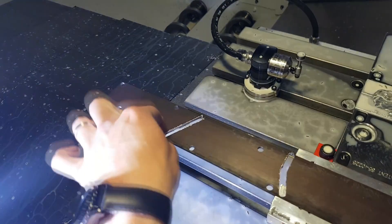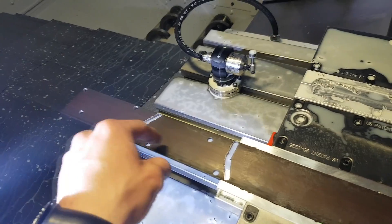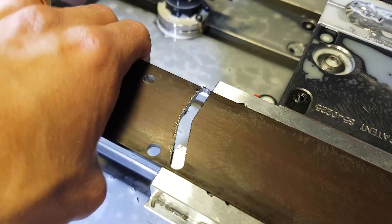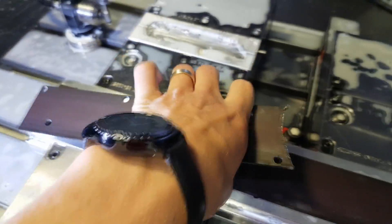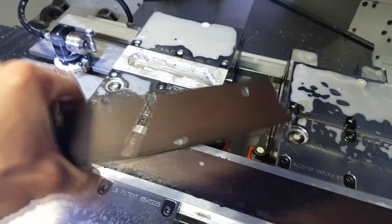I'm drilling three holes per blade plus one entry hole. I drill an entry hole and then shove an end mill down and slot it apart, then do the two handle holes. The top notch is already broken and then it's relatively easy to break it apart like that — easier with two hands when you're not filming.